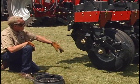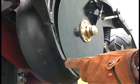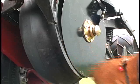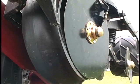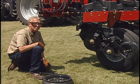Now that we've got that depth gauging wheel off, we've got a lead coulter on this double-disk seed opener and a trailing coulter. This trailing coulter operates just in the shadow of that lead coulter. You want a nice, sharp furrow point.